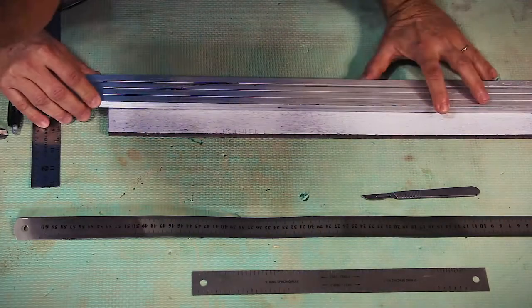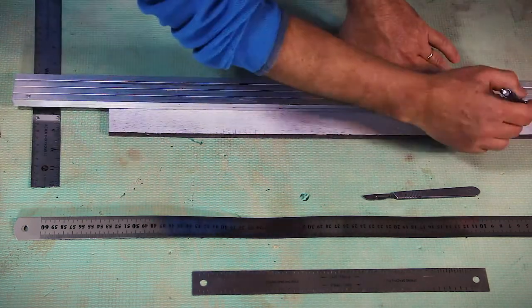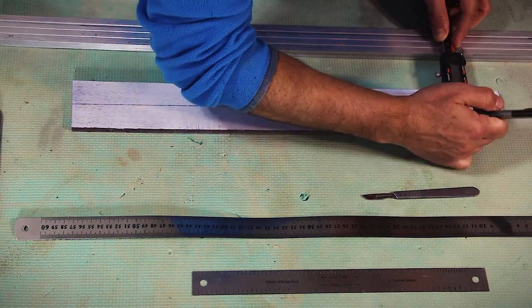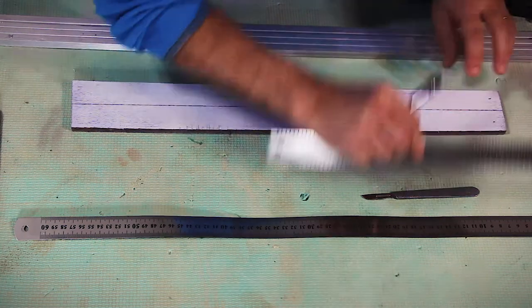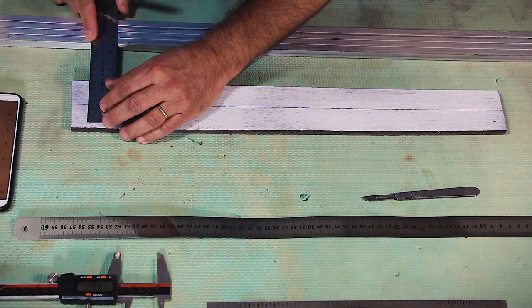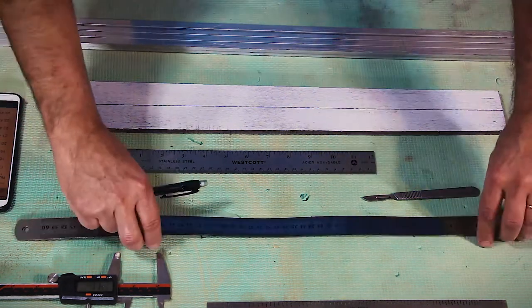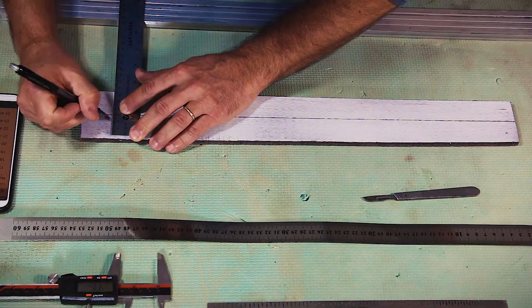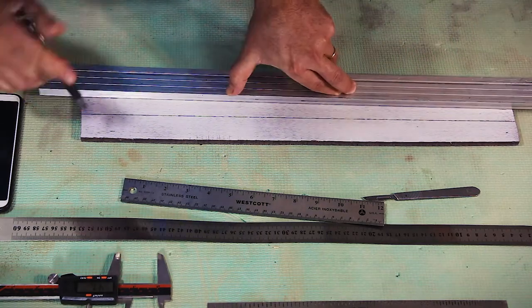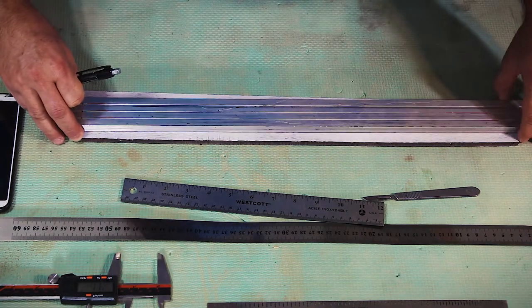This fretboard is not exactly square, so I'm just going to measure the midpoint on either side and make my center line. The scale length should be measured on the line of the string itself and not the edge of the neck, so I'll calculate the 42.2 millimeters at the nut divided by two, and subtract 3.2 millimeters or 1/8th of an inch from the edge to get the string position itself. At the heel where the 22nd fret would be, it will be 56 millimeters wide, and I'll also subtract the 3.2 millimeters to get the actual string position. I'll have to work out the exact spacing and angles of the rest of the strings when I deal with the nut, but for now that's all the math I need — the rest will be calculated for me.